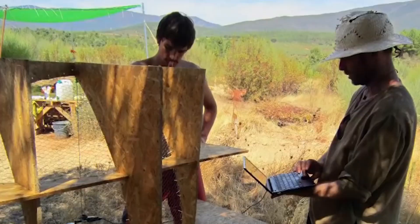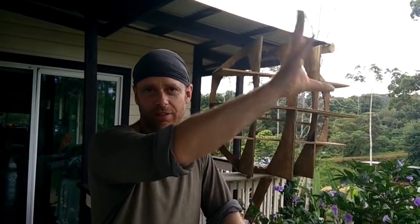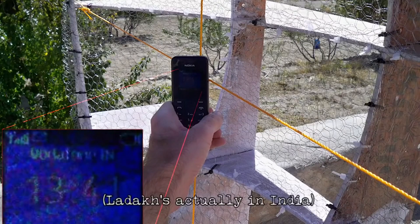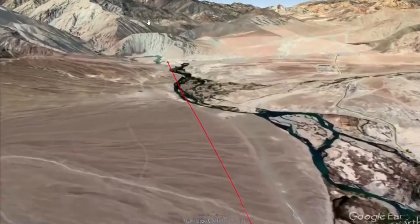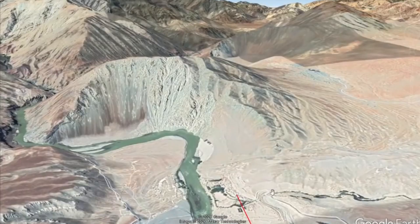I packed that through my laptop into the rest of the building via Wi-Fi. I've tested this — I've made these in Spain and got four-and-a-half kilometers range with line of sight, just to a basic home network at the other end. I also made them in Ladakh in the high Himalayas, in a place called Sekamol. We were going to beam internet from Spatuk Monastery up to Sekamol, down the end of a river valley — about seven-and-a-half kilometers with a dish at each end, like we've got here.